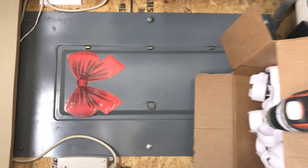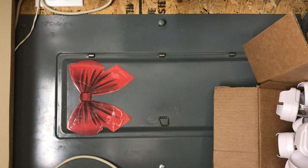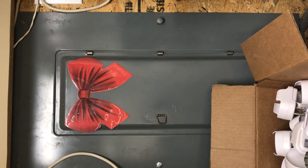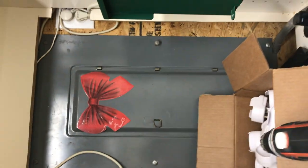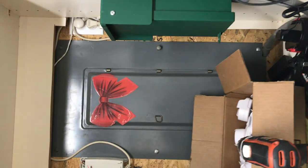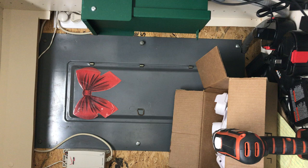The existing indoor panel is going to become a load center instead of a service panel, so I'm not going to replace that. This new panel will go on the outside of the house, and I'm going to put my 200 amp service into that. That's what I'm into this evening — hope you guys are having fun, because we are! See you next time. Love y'all, bye.